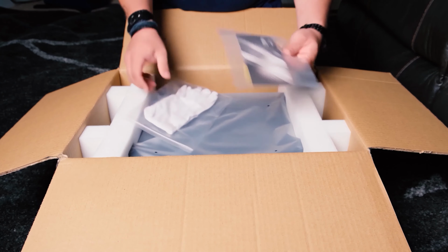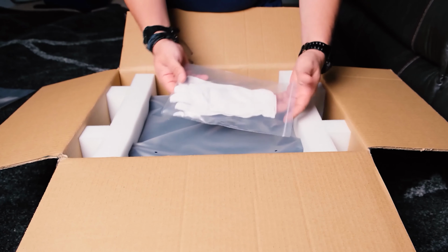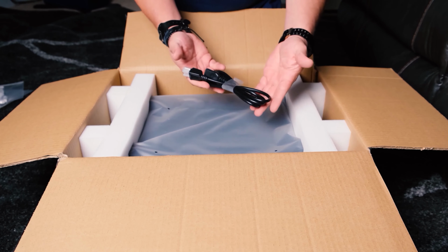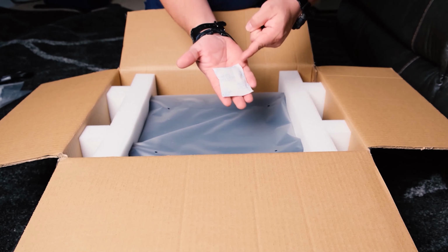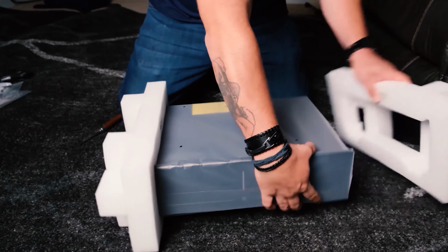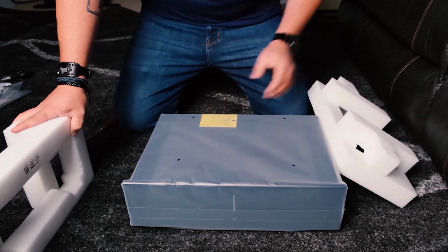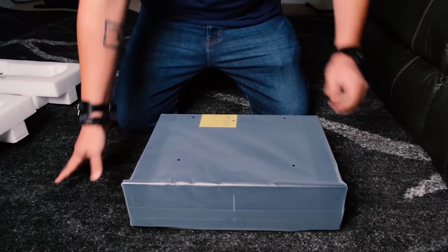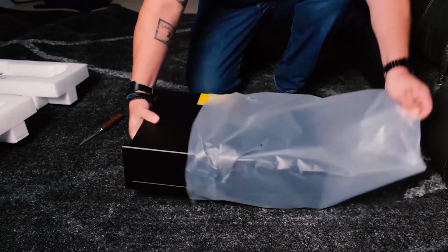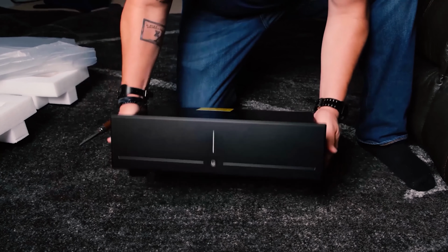The Starke AD4 is a 4-channel amplifier. At 8 ohms, it does 225 watts RMS per channel, and at 4 ohms, it does 320 watts RMS per channel. Now, this is bridgeable, so you can run this in either 4-channel mode, 3-channel mode, or 2-channel mode. When you bridge this, it puts out 430 watts RMS at 4 ohms and a staggering 650 watts RMS at 2 ohms. According to Starke, this amplifier was engineered to have a warmer sound than your typical Class D amp, so it's not supposed to be as cold as you might expect. I'll talk about that in a little bit.